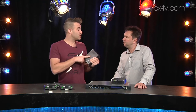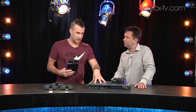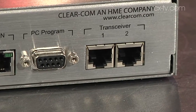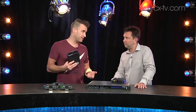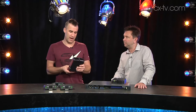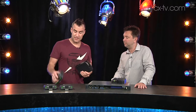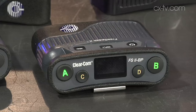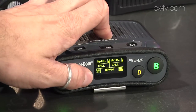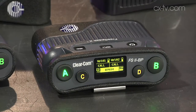So if you've got FreeSpeak 1, a firmware upgrade and you're already on the upgrade path. Then we've got these — the active antenna transceivers. This handles all the audio and supplies power to these. They're available in 1.9 and 2.4 gigahertz, as are the belt packs. This has got two ports on the back to run antennas, but you can get a splitter which lets you run five per port. You can even remote those up to a thousand meters away and just power the antennas locally. These are IP65 rated, as are the belt packs. There's a drop-in charger available, and the belt packs will run for up to 18 hours off the internal lithium-ion batteries — or if you're desperate, you can put a couple of AAs in and they'll go for about six hours.